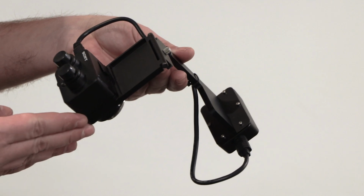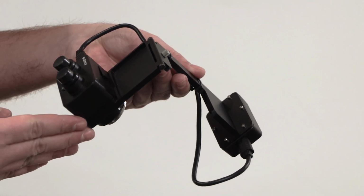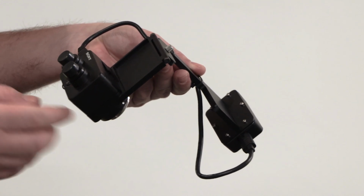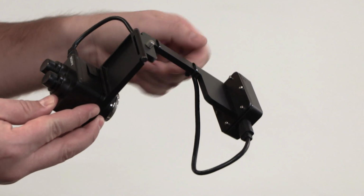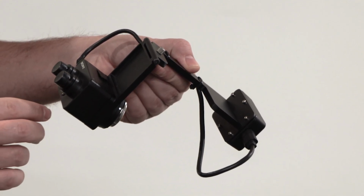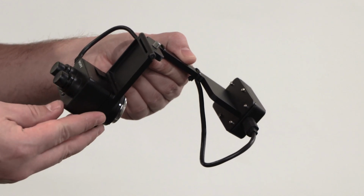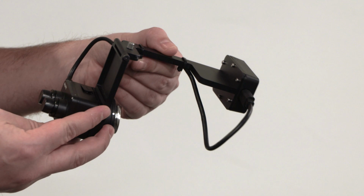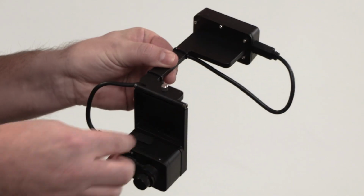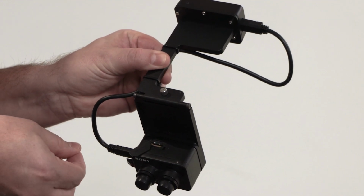Let's take a closer look at your Sony Ag Solutions camera. It has 2 major components: the camera, RGB and NDVI, and your GPS unit. At 400 feet AGL, your NDVI has a 4.6-inch per pixel resolution. The RGB has 1.9. It is all integrated with the cables and the bracket, and you also have your SD card slot for your micro SD to secure your data.